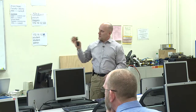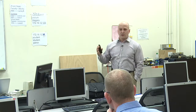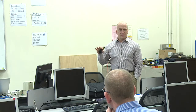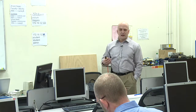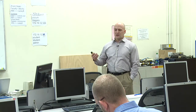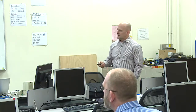A few basics about the circuit. Current flows the same in the same amount through every component of the circuit, okay? All components are going to drop voltage along the way. And this is important because this is going to tie into an analogy for remembering how to wire these. They're insensitive to electrical interference noise, very insensitive to that, right? They're not going to pick up stray signals and add voltage and mess up your signal. They're very stable circuits. They have a live zero.